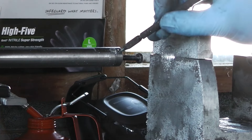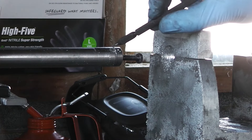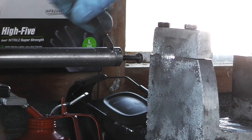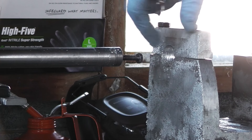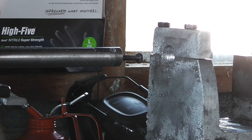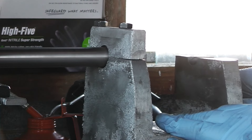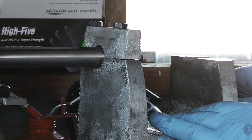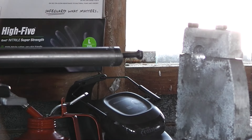I found the reason it's cutting badly — there's a little pocket where I provided rake for the cutter, and it clogs up with shavings from the Zamak in no time flat. Once it does clog up, the cutter stops cutting. But if I clear out the chips, it starts cutting again until it gets clogged up and the cycle repeats.